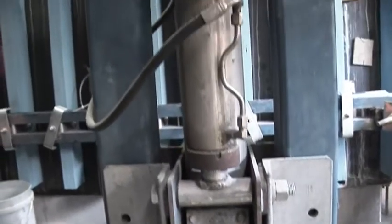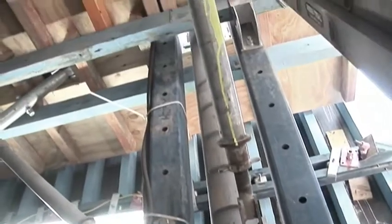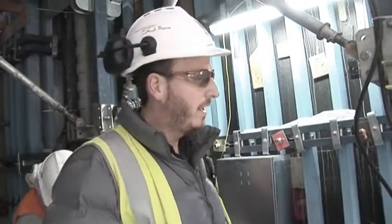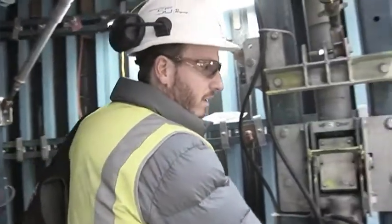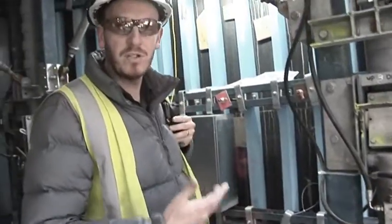Once we're in our next position, there are pockets and feet that go out underneath on the deck we're standing on, and that locks the jump away and allows us to work on the next lift. We also have to bring up the jacking deck from below to allow us to jump the next time. In that situation, the ratchets and the rams work in reverse and pull the columns back up, bringing the jacking deck up from below.